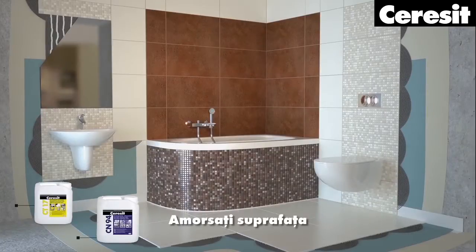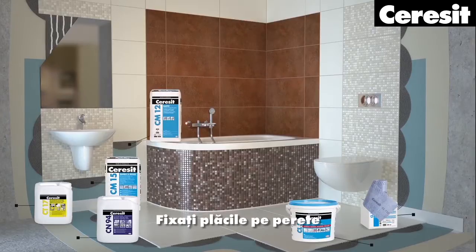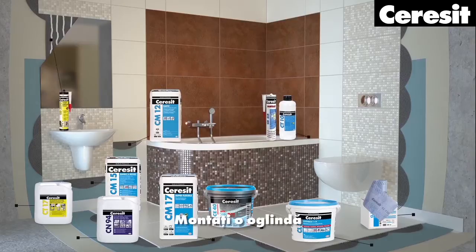Prime the surface. Apply the waterproofing. Fix the tiles on the wall. Fix the tiles on the floor. Grout the joints. Seal with silicone. Impregnate. Installation of a mirror.